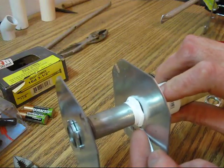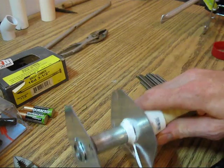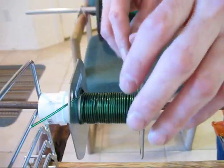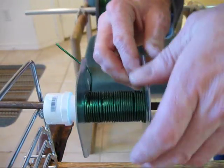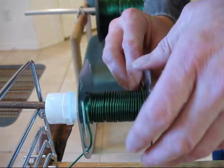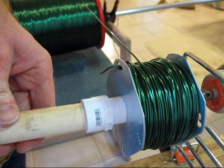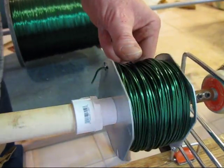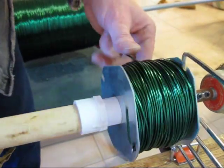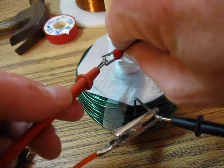Plumber's Teflon tape will protect the jagged edges of these lock nuts. I've rigged up a jig to wind as much 13 gauge magnet wire onto the core as possibly fit. 16 or 17 gauge magnet wire would probably work better for this project, but I don't have any so I'm using the 13 gauge. There needs to be as many turns as possible to get maximum magnetic flux and enough resistance to prevent wasting power to heating.